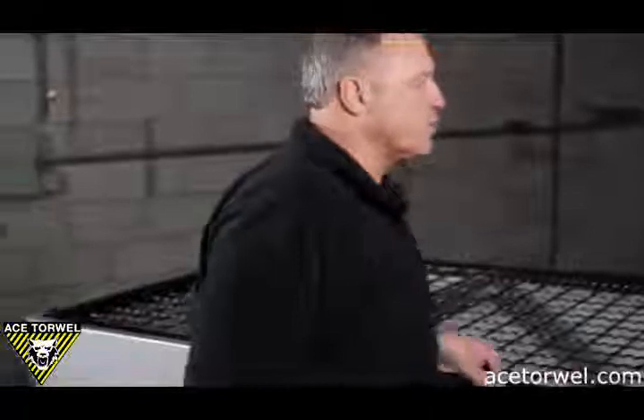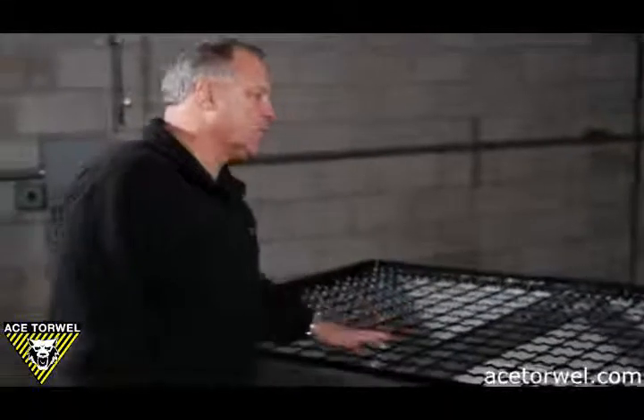The hopper is supported by a minimum of three gussets welded to the hopper body and to form base channels. All of our hoppers are fully welded on the outside seams and bends; structural bends are put in to stiffen the body of the hopper itself. On the inside we have a stitch weld system, and on the bottom of the hopper we weld in what we call chain guides, which actually reduces the torque required for the engine to pull the chain through the sand system.